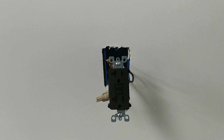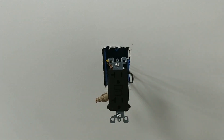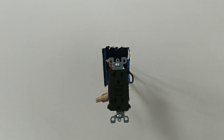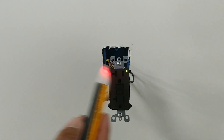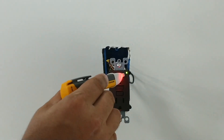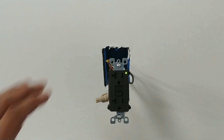Because I don't actually want a GFCI in this location, I'm just doing this as an example and won't be stuffing it in the wall. But I do want to show you: the power is now on, and the line side is hot while the top receptacle is dead. The top is dead because after installing a GFCI you have to press the reset button. Once we hit reset, the indicator light comes on confirming it's working.